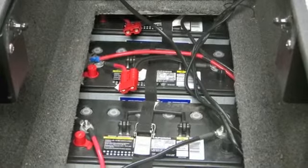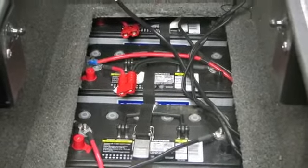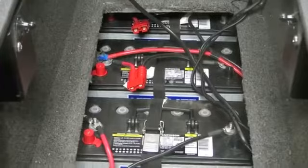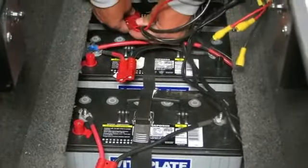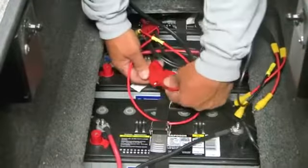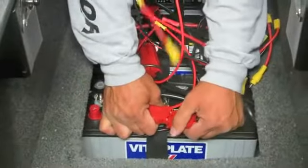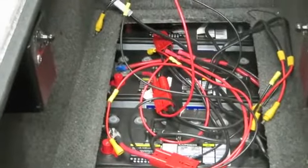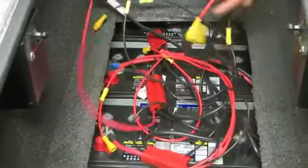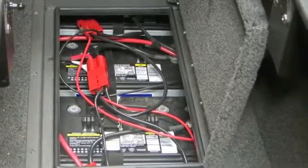So now you get a true picture on how tight some of these battery compartments can be. Now just imagine trying to be down there and wiring in jumper wires to make your 36 volt series. I showed you before how I built this up above. Now I've got the batteries down in place. All I need to do is drop down in here, plug the Connect Ease plugs together. Just simply this fast. And my entire system is now 36 volts. It's just that easy. All I got to do is finish hooking my fuses back up for my onboard charger. So we showed you how simple and easy this system is to put in the boat and how clean it is when it's done.